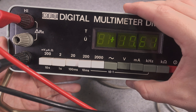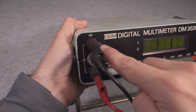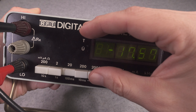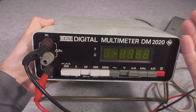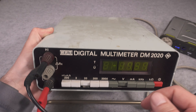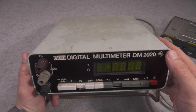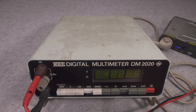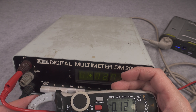We have the positive indicator. If we swap our terminals and reverse the high with low, as you can see we now get a negative sign — it's working absolutely beautifully as intended. Let's take a look at the ammeter. I'm currently around 120 milliamps, so we go to DC, zero it, and let's take a look.